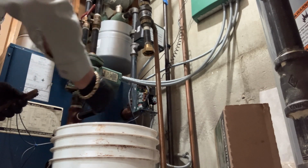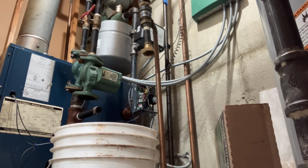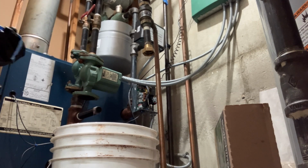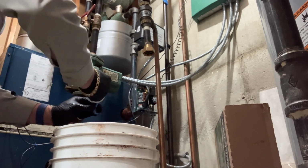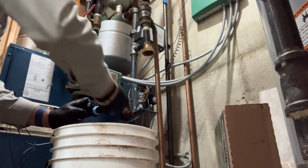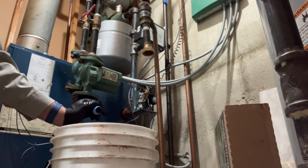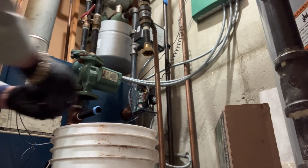Like I said, if the eventual intention is to change the basement into a separate rental, then you want to have the thermostat in a lock control area like this boiler room. You'll put a real lock on here, and you'll have the 3 controls or the 3 thermostats, which are basically remote computers that are hooked up to the heating system, reading that remote temperature sensor. Wireless. Yep. And I can always move it to wherever I want. Correct.